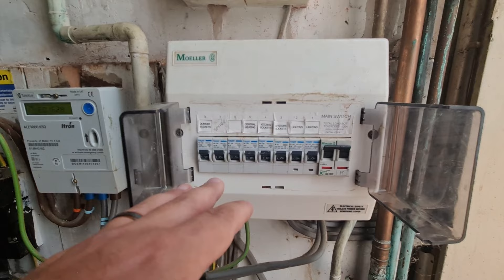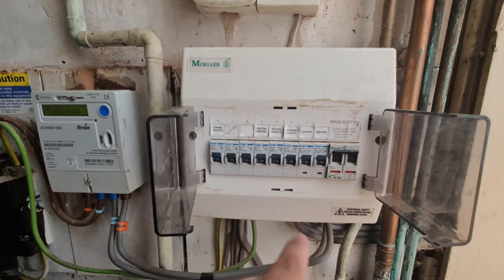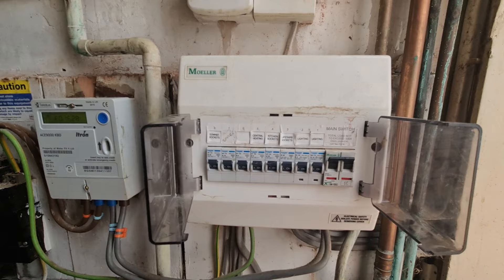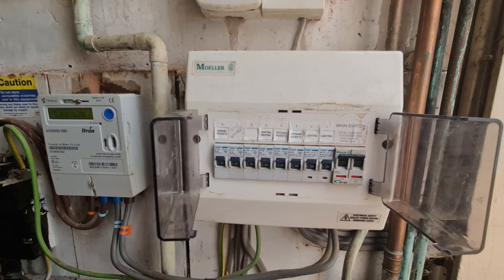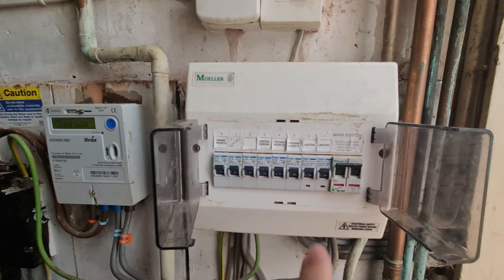One of the reasons I do some dead testing first is basically just an IR test to see if we've got good insulation resistance on these circuits. It kind of leans me towards the level of sampling on the circuit accessories - how much we're going to work and have a look at before we delve into all of that. Otherwise you can dismantle the system and potentially introduce a fault that wasn't there to start with. If you go along these lines first, you know that what you're observing is something that's existing in the system. Other people approach it differently - there's no set rules as long as you come to the right conclusions.